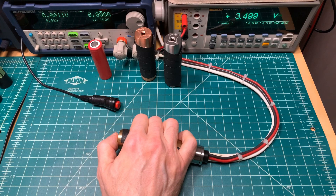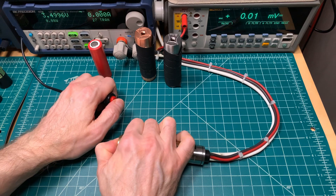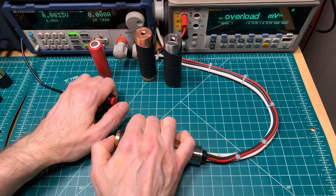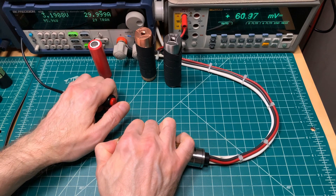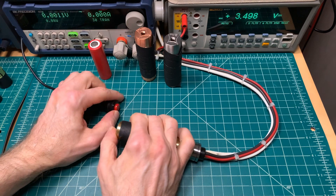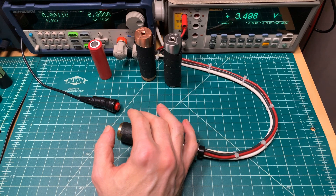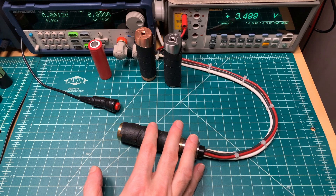The Tauren Max was 0.061 with its conductive grease, and about 0.042 with the grease taken out. This is reading 0.059, 0.059, 0.06. I'm going to call it 0.06 volts, which is very good. That's a big change — one-fourth the loss compared to with the grease in it. So for me, it's definitely worth it to take the grease out.